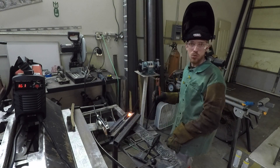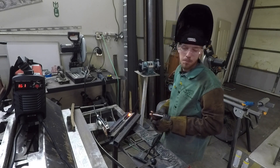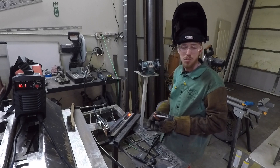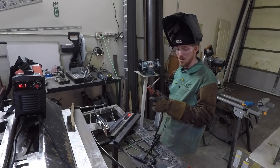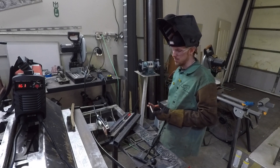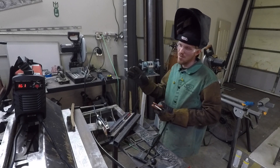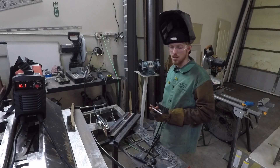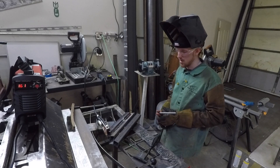So it definitely does run it, but it is stuttering a bit and you have to have a perfect arc length. You get the idea though — for the price, that's pretty impressive to be even running this heavy end of electrode. Anything down to 1/8" it seems to run pretty much very well. Now for arc strike, it doesn't really have a hot start so you might have to touch it a couple of times, which is annoying. But overall arc performance is a lot better on 240 volts or 220 volts.